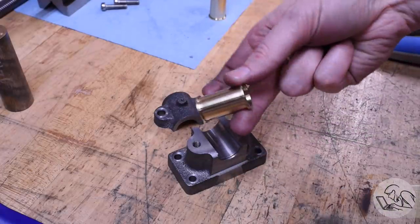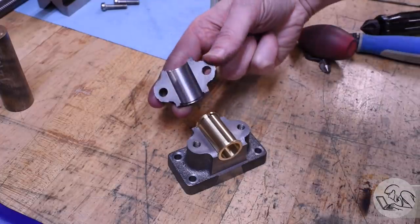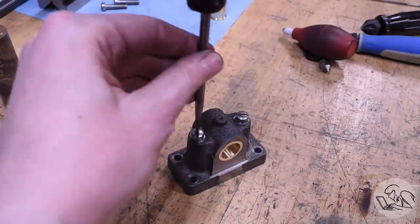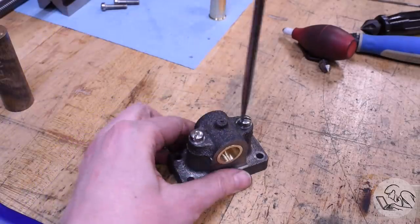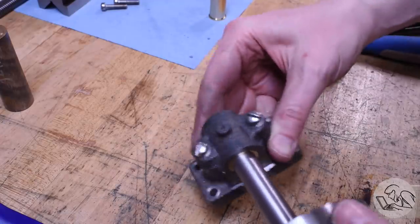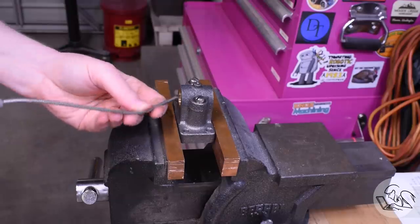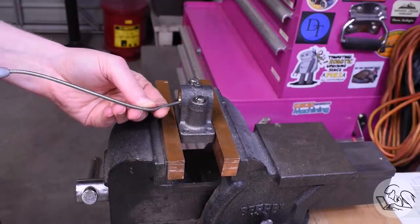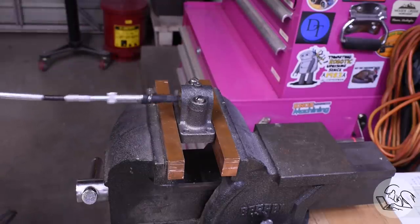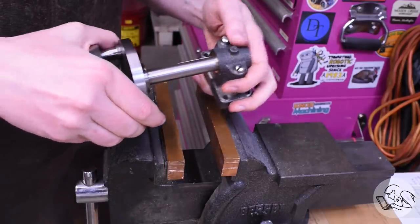There are my final bearings - I made two of those - and they should seat nicely down in the bearing caps, then I can put the caps down on top. Interestingly, once I torqued down those bearing caps, the crankshaft was a little bit tight - the bearings being compressed ever so slightly - crankshaft still fits but it's a little snugger than I would like, I lost some of my oil clearance. That's an easy fix - with the caps still torqued in place I just brought in my little honing tool and ran that through very briefly. It's bronze, it cuts very fast, and just a few seconds with that was enough to where that crankshaft once again fits well and spins freely.